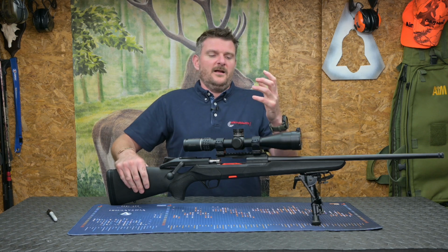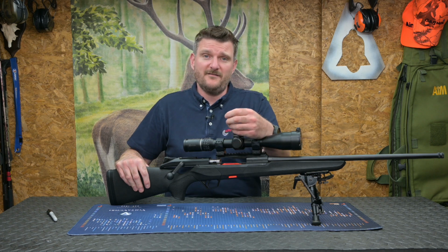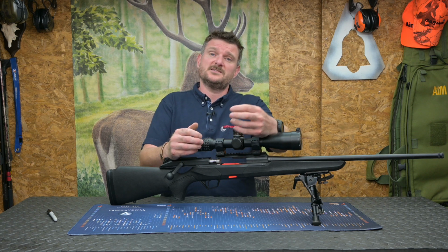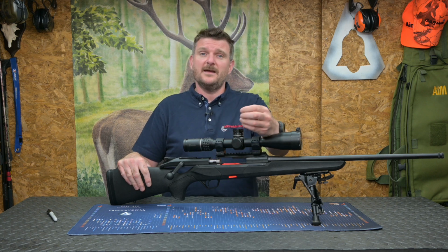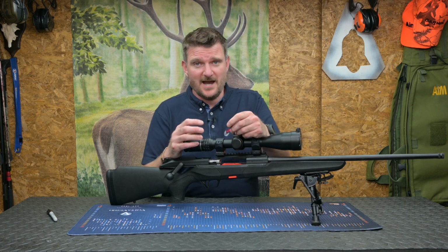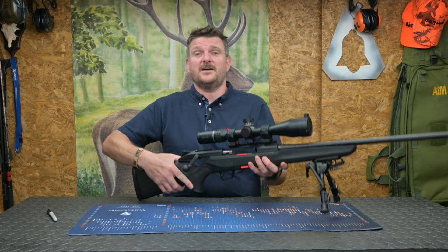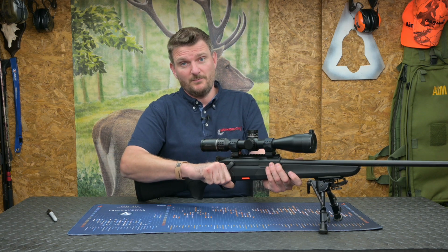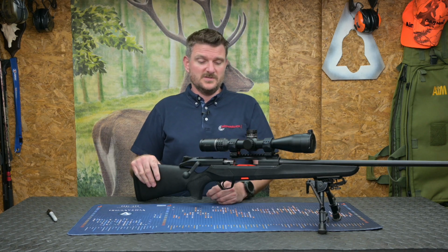Because if you were pulling that immediately against that locked chamber, it would be a lot of effort. Now this is different really on a straight pull manual rifle, because if you imagine this is in an AR-15, as it was designed to be with the gas piston in it, the instant that rifle fires, it develops pressure. So there's not really any time for the case to remain long in the chamber as it's hot and gets sticky. And that's where straight pull rifles, which have been converted AR-15s, it's good to have a really good bolt handle on it so you can really open it up quickly. And this is pretty similar in those respects.